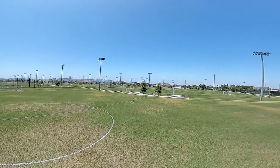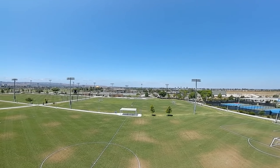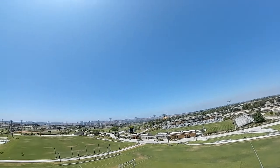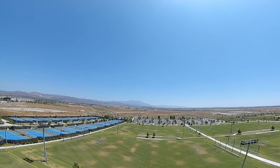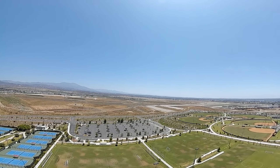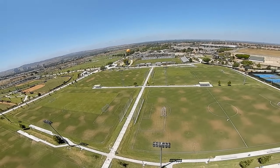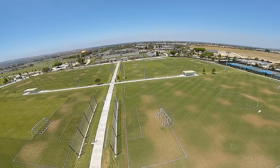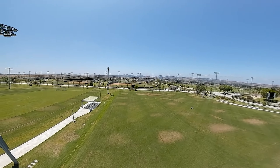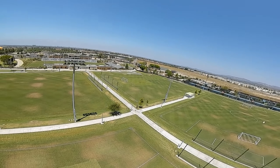Let's go off in this direction — the home arrow seems to be working. I'm going to test the GPS rescue on the switch. There it is — it's turning around, climbing, and bringing us back. The altitude must be set pretty high — I thought it was 50 meters but it must be higher. I'll double check that later. GPS rescue is working. The OSD elements keep glitching and disappearing briefly — I'm wondering if it has something to do with my SD card.